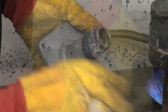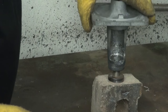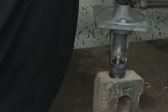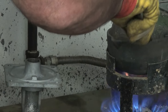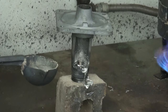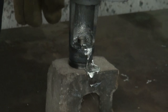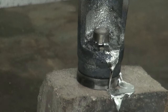Using a little plug mold that Nick made, we dry-center it up. He's going to pour — giving a ladle full of Babbitt and pouring it in. Looks good. We'll let that cool down, and when Nick gets ready to do the machining, we'll knock that plug out and he can bore out that bearing.